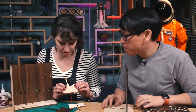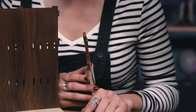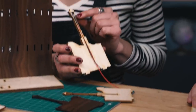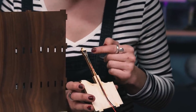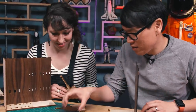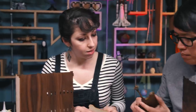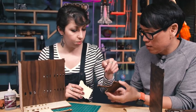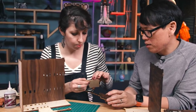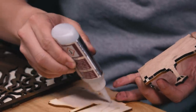One cool little feature is this lamppost has an LED inside, and the back has a cutout that perfectly matches the shape of the 5mm LED. So you can just pop that right in there and then run the wires on the back — it becomes a channel and a bracket. This one actually has three layers. To create the illusion of snow being on top, that layer goes behind, then the walnut layer is the visible lamppost, and then your snow layer goes on top.